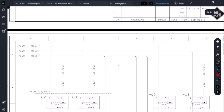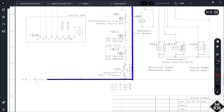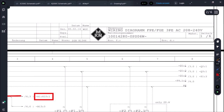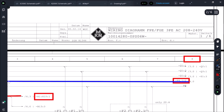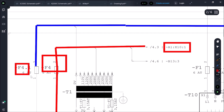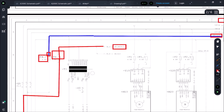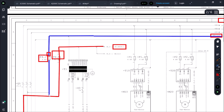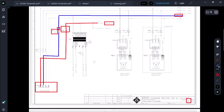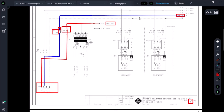The second leg is F4.1.2, which is at section 2.8. Going to page 2, section 8, we find F4.1.2. In less than five minutes we've drawn out the entire power path for the control board — bypassing the contactor, straight shot on L2, coming up through two fuses. It's also pointing us to page 4.3.